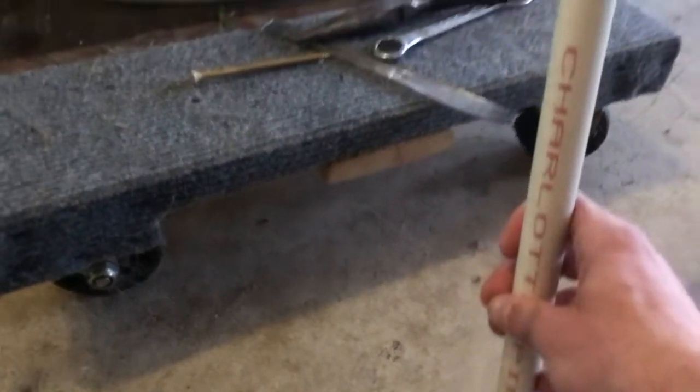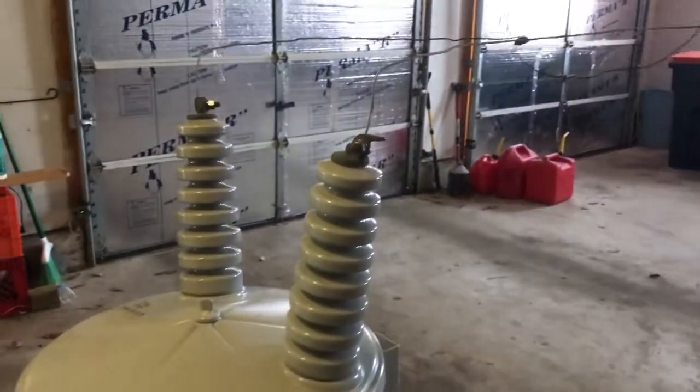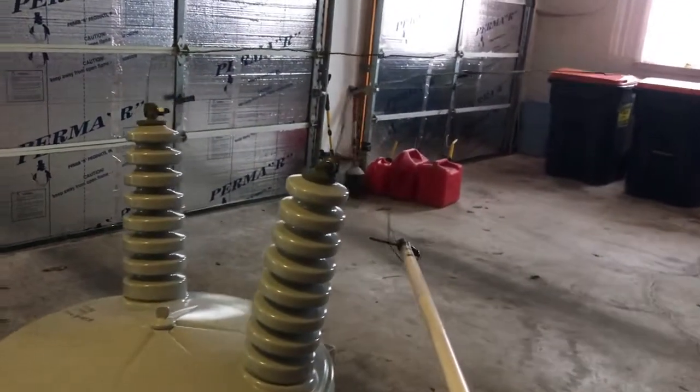Make sure to grab down here, because you can still get a nasty shock off one of these even though they're not grounded — just the capacitance in the core. It's enough to potentially kill you.